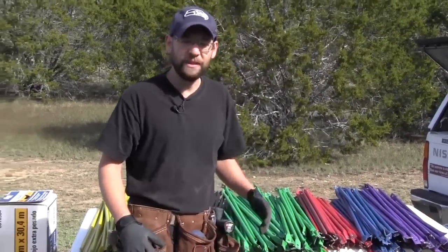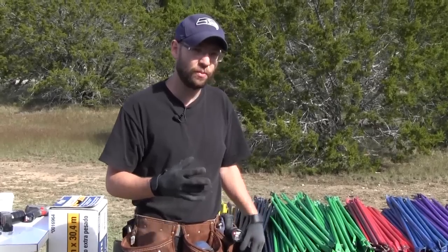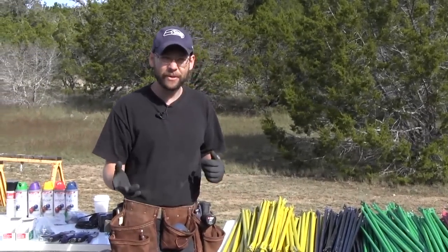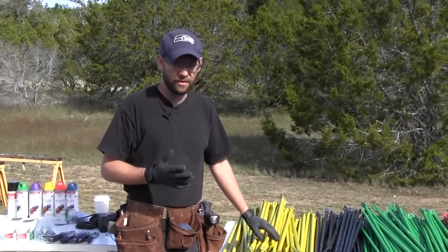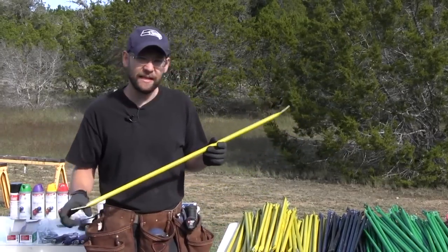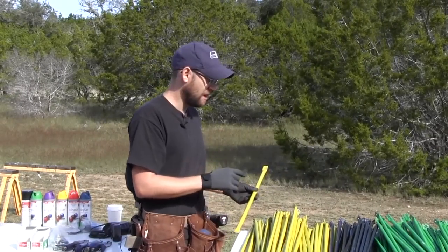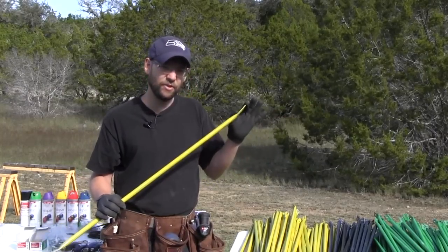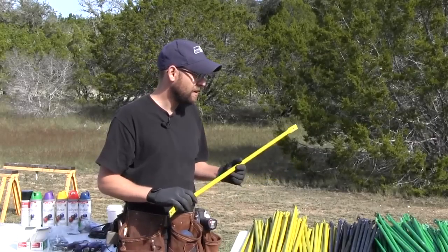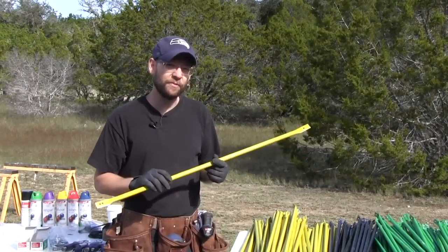This is a 4V dome, and a 4V dome is very, very strong. The more joints you have in a geodesic dome, the stronger it will be. We're going to be building a 19-foot diameter dome today — that ends up being about 260 to 280 square feet of space. The great thing about the geodesic design is if you want to increase the space, it doesn't increase the number of parts. All it does is increase the length of the parts. So this is a 255-piece system — if you built it at 30, 40, or 60 feet across, it would still be 255 pieces.